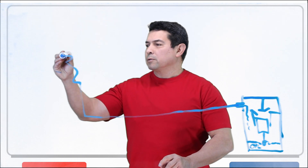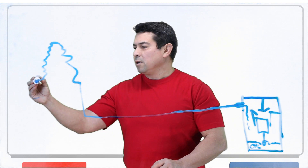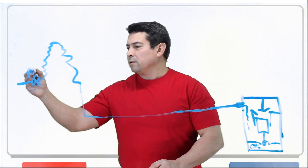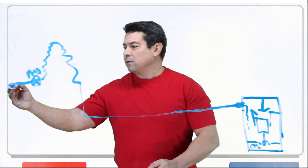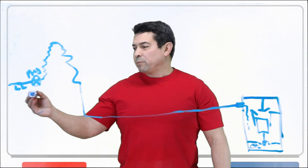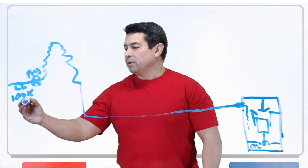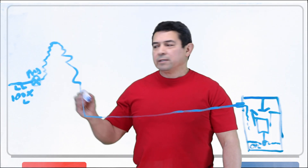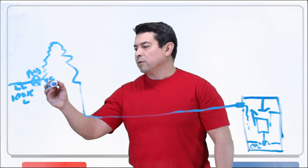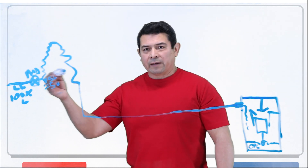The refrigerant is going to come from the evaporator. So we have the evaporator getting the refrigerant from the metering device — that's my liquid line right here. Coming into the metering device, we're supposed to have 100% liquid. Coming out of the metering device is going to be approximately 75% liquid, 25% vapor.